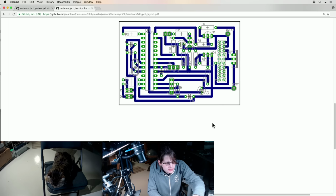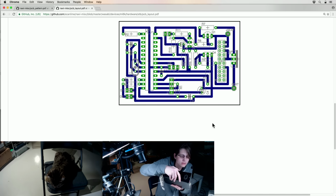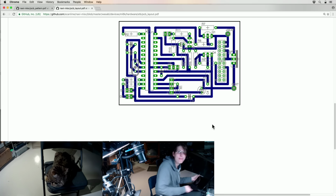I'm also going to look for signs of whether we can just find a data sheet for this VFD to get an idea of what it's expecting. Because maybe we just throw some existing RS-232 adapter at it and we're done. Ooh, there's jumpers to set baud rate. And there's a self-test mode. Let's go back to the camera. I'm going to check the chat too. No more movies.